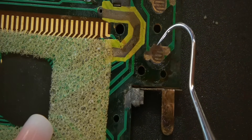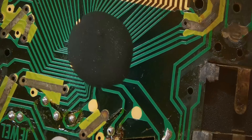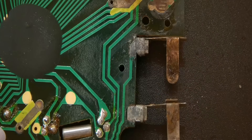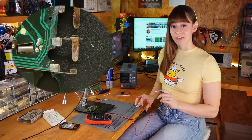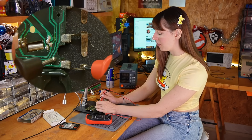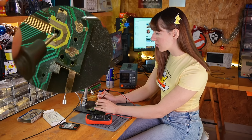I'm wondering if this contact point is still making contact. Looking underneath, it actually looks fine — everything looks good. So I'm guessing the corrosion from the batteries ruined this part of the board. Now let's check the traces with the multimeter — if they actually make contact, the multimeter should make a sound. I'm going to clean the board anyway before testing it, but just to be safe let's check all the corroded parts. So far so good.